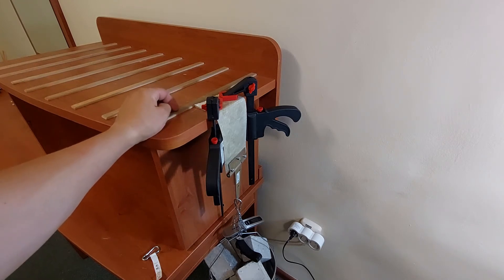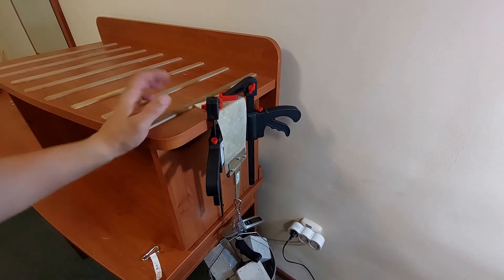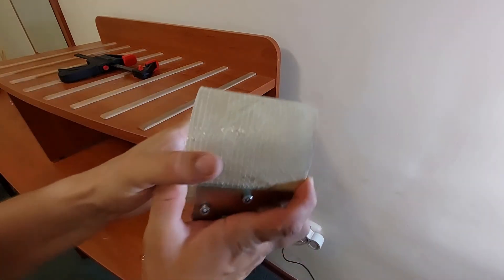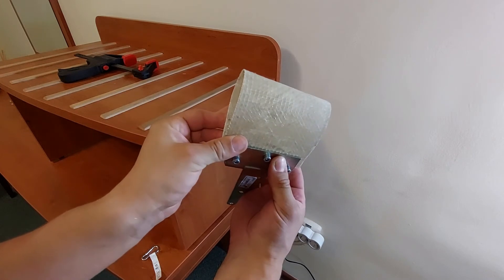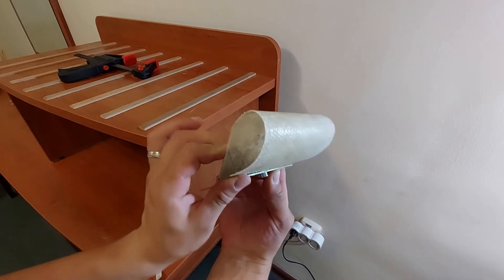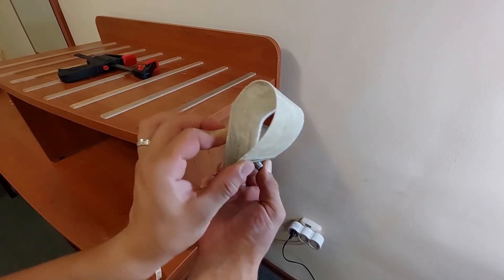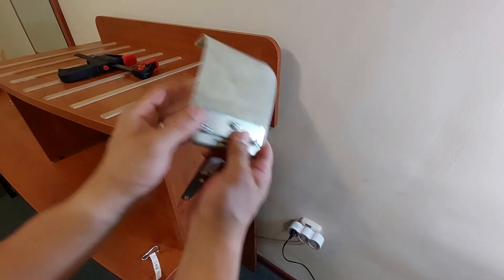I think from many of you this episode is not satisfying, and for that reason I will try to break them manually by hand. I will start from the end. Stitched roving, 850g per square meter, laminated with vinyl ester resin — it looks like it didn't break even when I bend one end to the other.